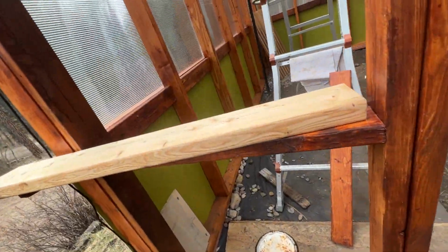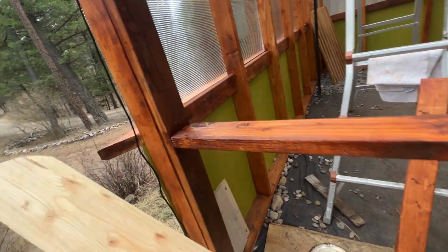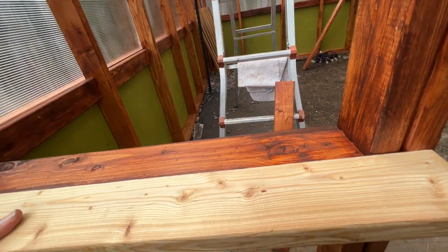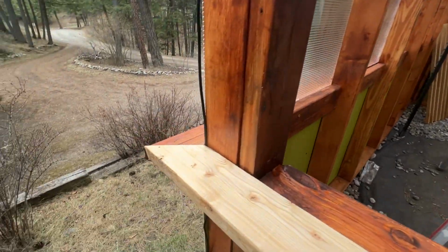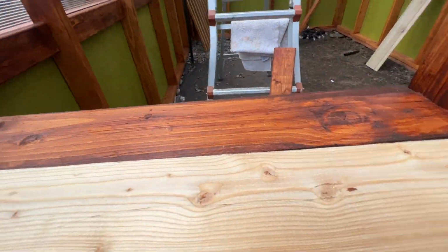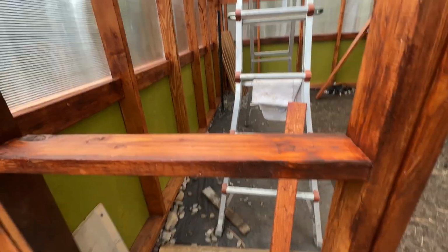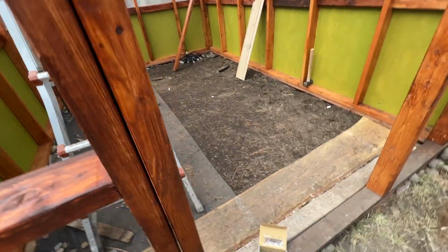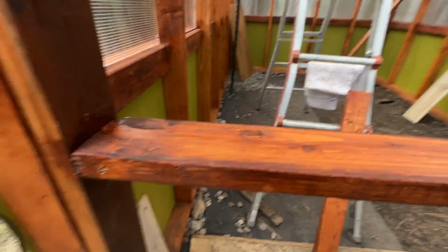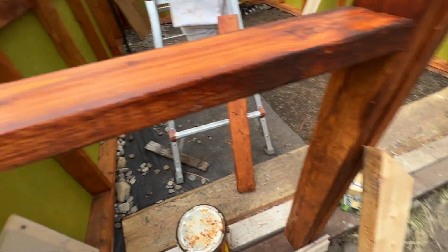Okay, so as I often do, and I think I'm being all fancy, I'm beveling this down and beveling that down to match. So now everything together, it looks like it fits just fine. Seams go good there and there, but I have to turn these boards sideways, up and down. So I do this all the time. I gotta undo stuff. This is why I screw everything in. Flip it upside down so that I can come through to secure these boards.